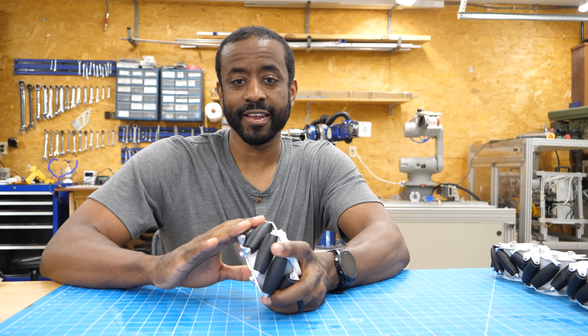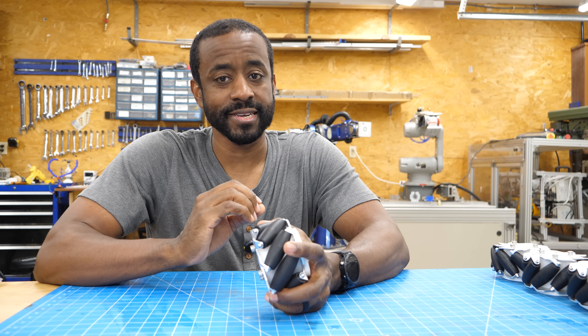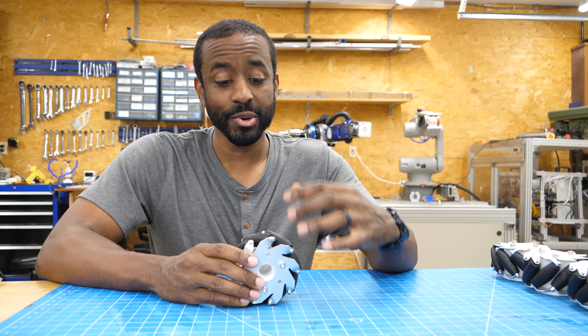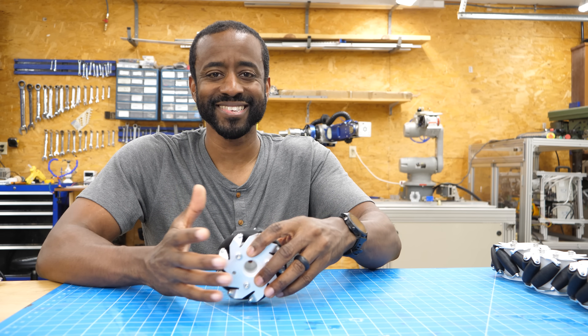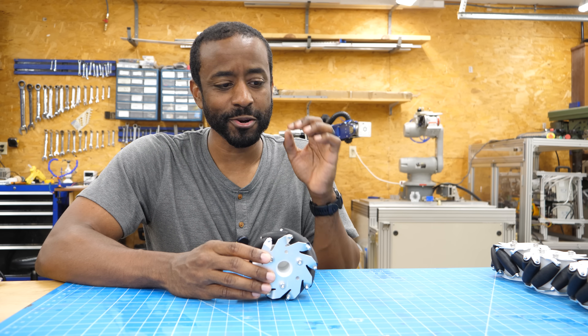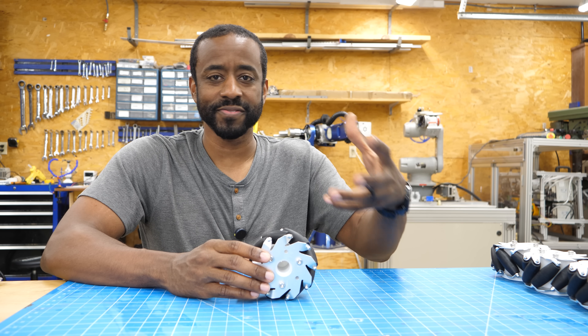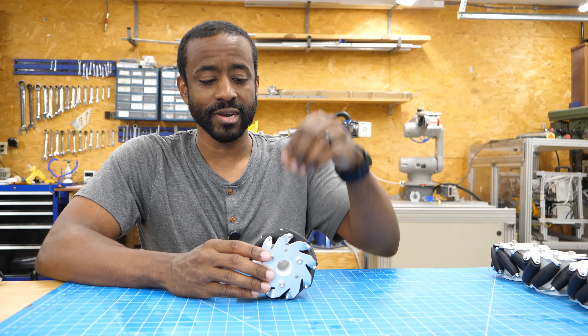In summary, you'd want to consider the Mecanum wheel in applications where maneuverability is of the utmost importance, the wheel cost is acceptable because you need to get into tight spaces, and you have ideal flooring conditions — not climbing stairs, but rolling into an elevator and maneuvering along flat, predictable flooring. The wheel isn't very precise because by design it can slip, but that doesn't mean you can't use it in precision applications. A robot arm on top of a Mecanum-wheel base can maneuver into position — it won't be perfect, but close enough — and then the arm uses a camera or sensor to detect distance, reach out, and grasp the object. Your precision doesn't have to rely on the wheels themselves.